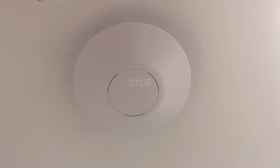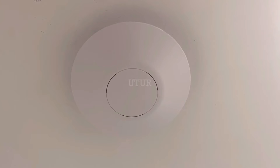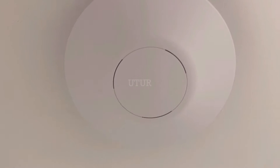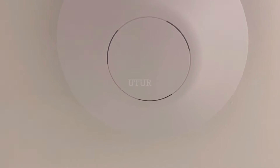Extract fans installed on the wall would have an ingress protection of 5, which essentially means that it can only resist a sustained low pressure water jet spray. Click on the link in the description for electrical safety zones with respect to the British Standard 7671.